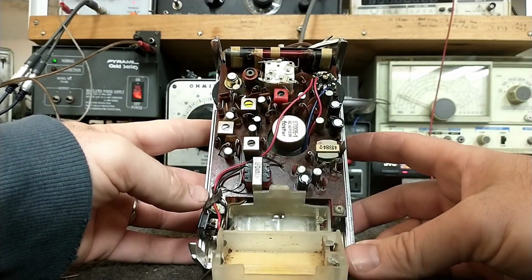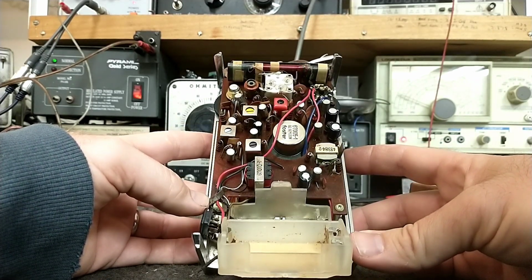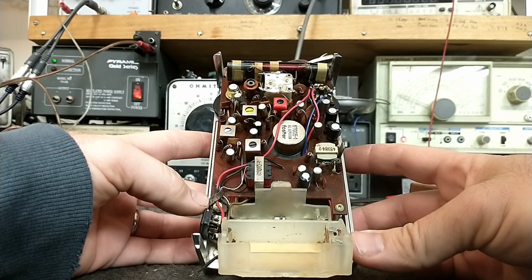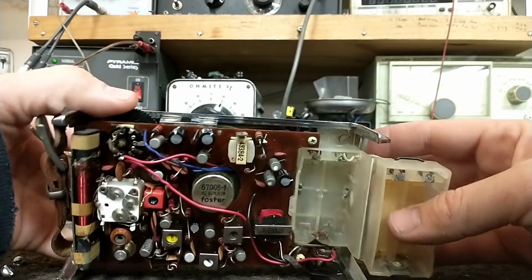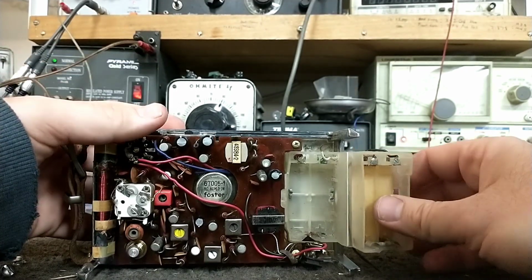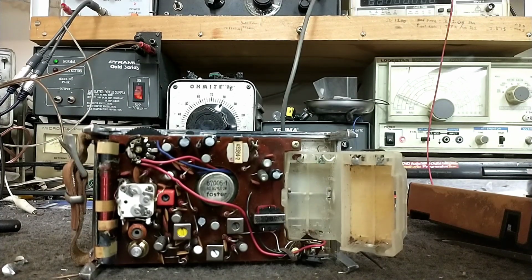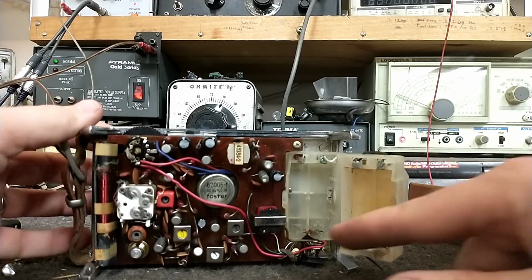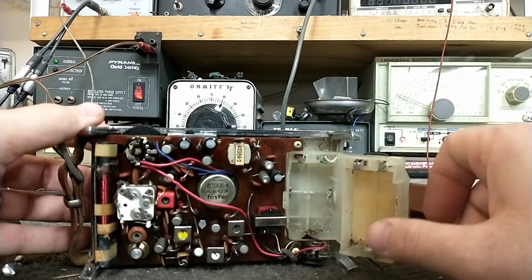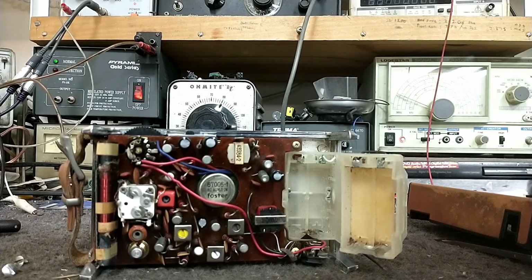So definitely got some work cut out for us, but we should be able to create a battery terminal of some kind that will work. I may have a spring or something that I can solder to that terminal pad down there once we clean this up, because that's pretty ugly. But yeah, a lot of fun ahead on this one. Let me get some tools. I'm not going to have enough room to put the Dremel in front of the camera, but you'll be able to see it. I'm going to try to clean up this terminal that's corroded here, and then see if I can find a spring that we can use to attach to that terminal so that we at least have battery conductivity.